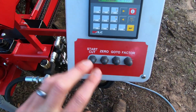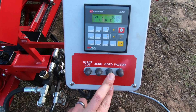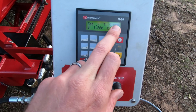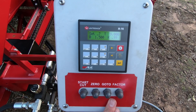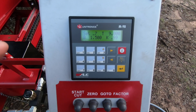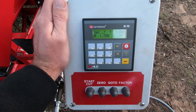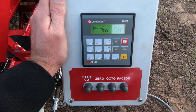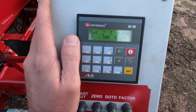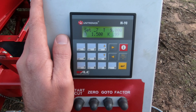For presets six through nine, go-to is going to give me a starting point. When I press that button, the head will pick up — it's going to raise itself generally about three inches, and it's doing the math. So in this case we've got the inch and a half board and nine inch cant. It will raise and I'm going to have set points where I'm going to cut inch and a half boards, and my last cut will finish at nine inches. That's going to give me any waste off the top of the log — so I'm not cutting down to nine and a half or ten inches. It takes all my waste off the top and does the math for me.